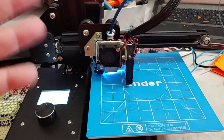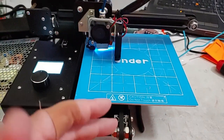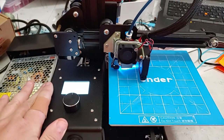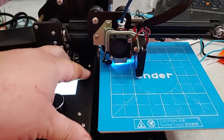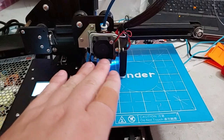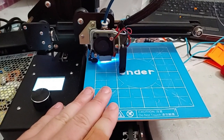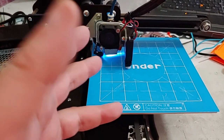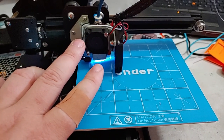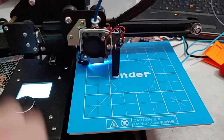All these parts you can get on Amazon. There's a kit that comes with this part, the tubing, and the springs. There's another kit you can get with the dampers and whatnot. If you're satisfied with the stock electronics, for significantly less money you can add these things. The fans were $15 and $20 but that was a 5-pack, so you're probably looking at $5 to $8 individually. Just make sure they are a decent name brand, dual ball bearing, and brushless — that's the trick for getting it to be super quiet.